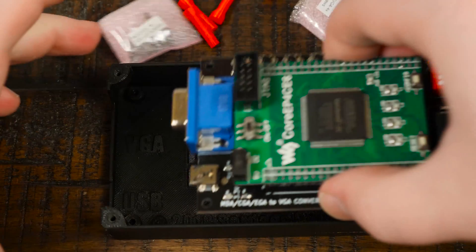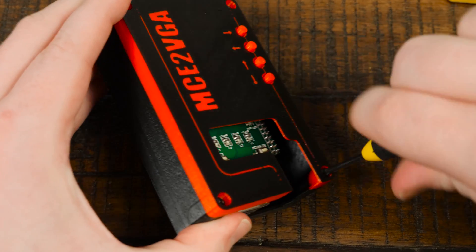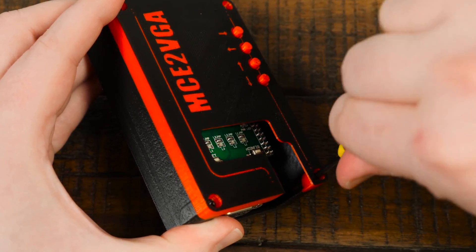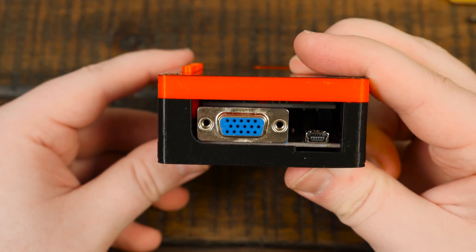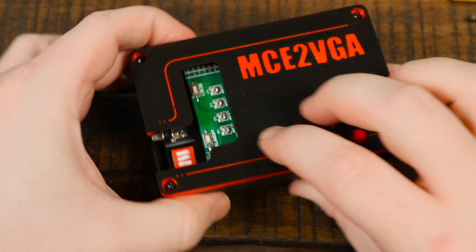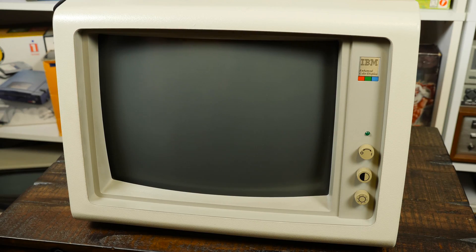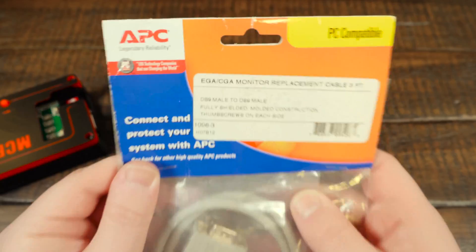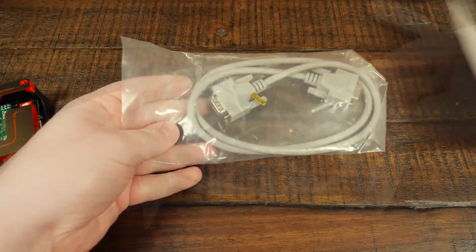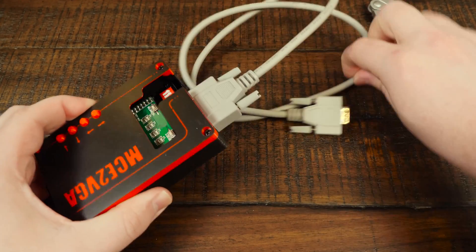Let's go ahead and try it out, which for me began with fastening the boards into the enclosure. This is a pre-production kit so the final version may change a bit, but even as it is the process is easygoing — only four screws for the PCBs, four buttons to drop into the top of the enclosure, and four screws to sandwich it all together. You're left with handy openings on the top left and right-hand sides to hook up your displays, plug in a standard mini-USB cable for power, and adjust the display settings on the FPGA. One issue I didn't anticipate though is how to hook up the RGBI side to my retro PCs, because all of my TTL displays have the video cable permanently integrated into the monitor itself. So I grabbed one of these 9-pin male-to-male D-Sub cables, which thankfully are still pretty easy to find online. Do make sure that it's a straight-through serial cable, not a null-modem serial cable, because the wiring differs and won't work for what's needed here.